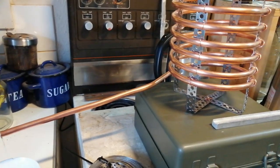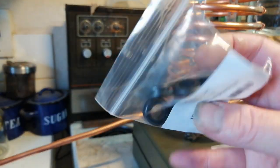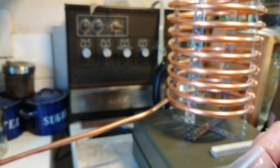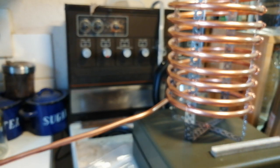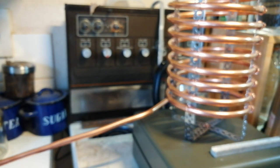I'm going to fit the grommets tomorrow — that's ten mil inside diameter and I believe it's a 12 mil. I'm going to open it at 11.5 and see if I can get them in because I don't want any leaks out the bottom of the bucket. There won't be any leaks out the top obviously.